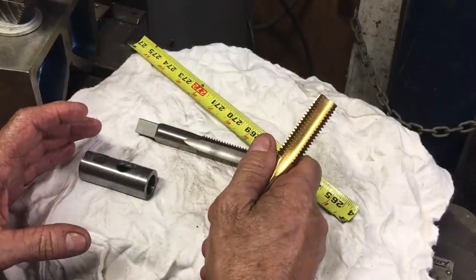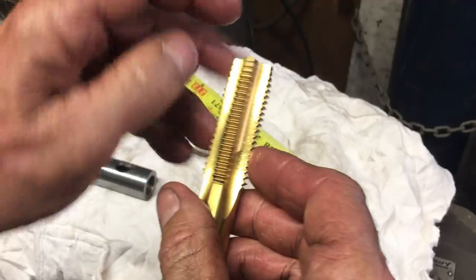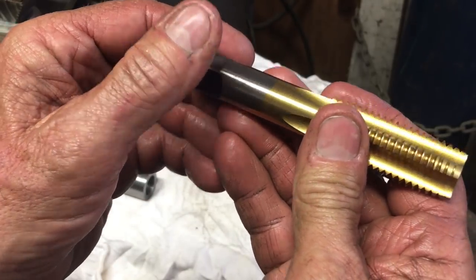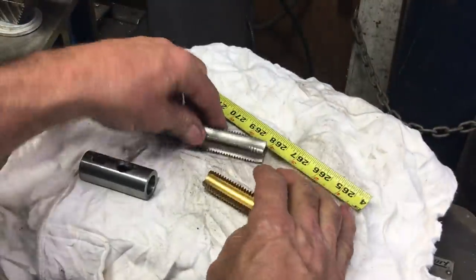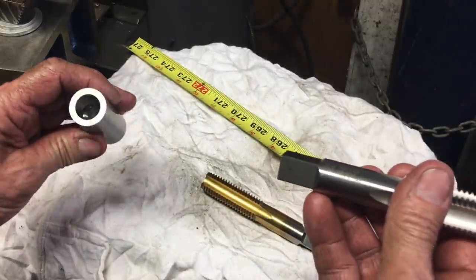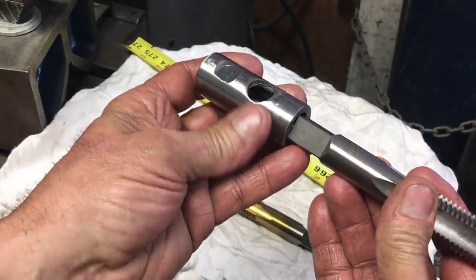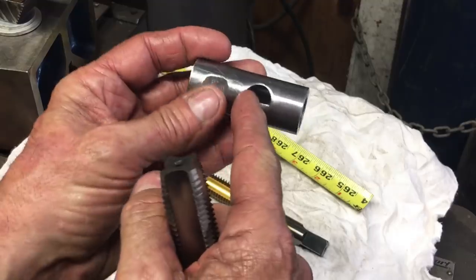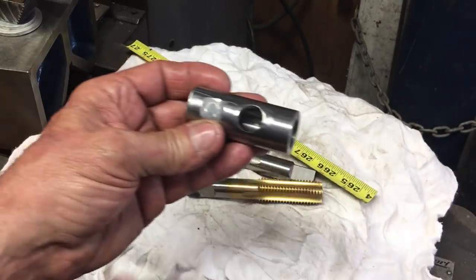I got all 24 of the 20 millimeter holes tapped. I ordered brand new taps from McMaster-Carr — SP USA series, not really sure who makes them, but very nice taps. Now I'm ready to switch over to the 22 millimeter. It's been a long weekend and I'm getting tired, so rather than making another bushing, I'm going to go ahead and just bore the inside to fit this tap. This was the one-inch that fits up inside the R8, and the two set screws — one goes all the way through the hole and locks in.